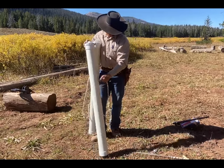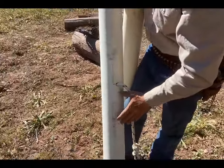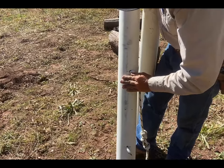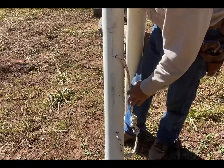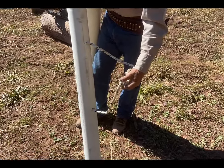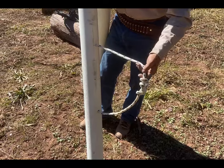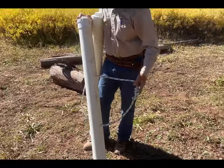What I did is I drilled holes right through the center. You can look at it. I can't remember what the dimensions are. I'll probably figure it out here. There's 4, looks like I went, there's 8, so 9 inches on either side of the center mark. Okay, that's what it looks like I pretty much did. And I used 1/2-inch yachting rope because it lasts a long time. All I did was a square knot and a knot on the ends of it. And that way I can adjust the sling on this or top sawbucks as close or far away as I wanted on these loops. So that's all I did.